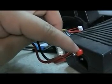You don't solder it right away — you have to look for a dummy connector. I have an old charger up here. Insert it here just to make sure. When you heat up the connector, you will not deform it. Sometimes if you apply too much heat, the red plastic holder will melt and deform the connector. To avoid that, you insert it into another female connector.